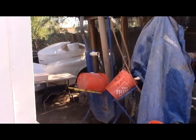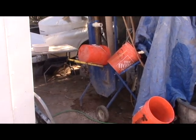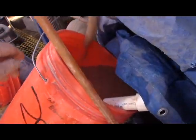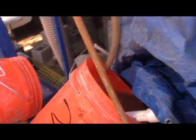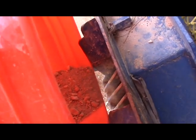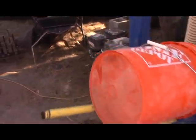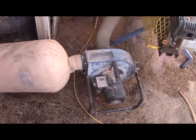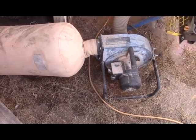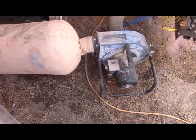I'm trying something that may work out a little simpler — let's see what happens. Here's the setup: we've got the impact mill going down there, running up to the dust collector, and the dust collector running down to the tailings bucket, leaving out the top super secret concentrator. There's the booster blower — running one pass with that on and one with it off, to see how it affects the grind. I know it doubles the throughput; I suspect it also forces the grind.